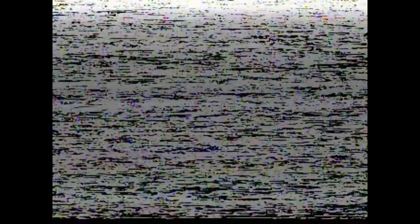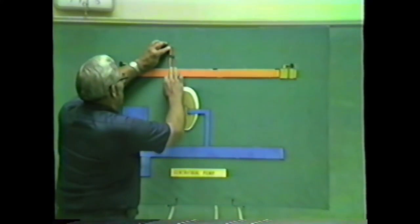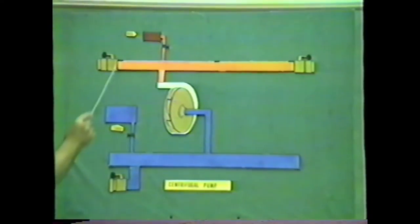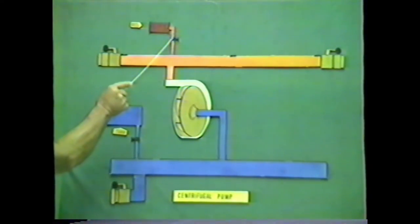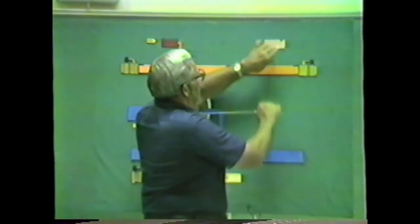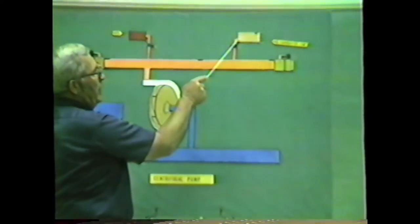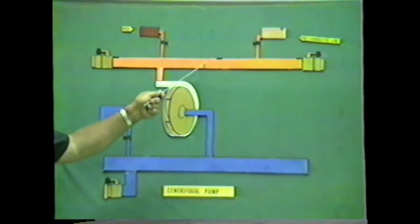Most everybody wants a booster reel on their pumper. If we want a reel, we come along and plumb it into the discharge manifold. The reel has hose wrapped around it with a swivel so you can unreel it like a fishing reel, and a valve controlled by the pump operator. Most modern pumpers also have pre-connected lines — usually inch-and-a-half or inch-and-three-quarter hose — already pre-connected to permanent plumbing going down to the discharge manifold. Anything that requires pressure must be tied into this discharge manifold.